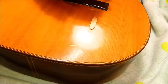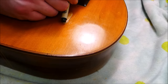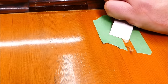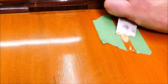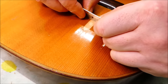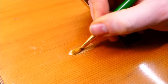With the addition of some glue, this will be a nice snug fit. I'll do a quick spot of cleanup, and then I'm going to compress the edges of the patch using the end of this pen. The spruce is compressible enough that it will deform and spread out a little and actually make a tighter fit with the soundboard. Carefully paring back the excess - the masking tape there is basically a reminder, it's not going to stop anything if I fumble it. Then I'll use a razor blade as a scraper to refine the surface, using the well-known trick of having scotch tape over the corners to prevent digging in. Gently bending the center of the blade lets it contact the patch. After that, I'll paint on some water to raise the grain - the surface will get fuzzy and I can go back with the scraper and smooth that out again.